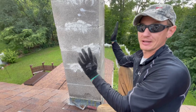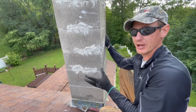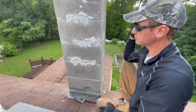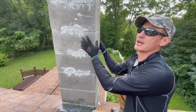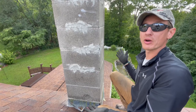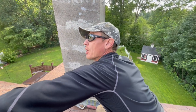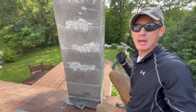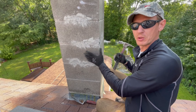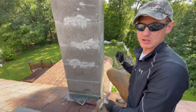These are chimney blocks. They make different kinds — solid chimney block and cored chimney block. The cored chimney block has holes in them, and those holes I call frost pockets or water pockets. Sometimes when you demo a chimney and poke a jackhammer through into the hole, they just pour out water because the water is sitting there and can't get out. They shouldn't even make cored chimney block — it leads people to believe you can build a chimney with cored block, but you can't. You have to fill each block solid individually.